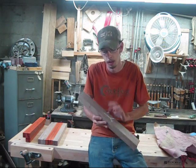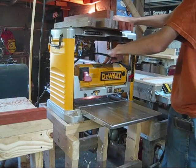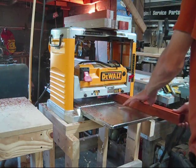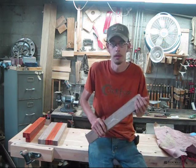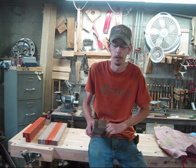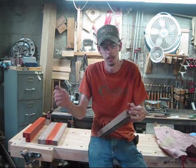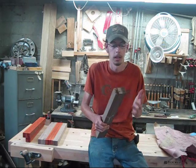Once you've marked the milled side, take it over to your planer, lay the marked side flat on the table, and run it through. That will make the top flat and parallel to the bottom. Finally, mill it to desired width at the table saw — rip it about a sixteenth or even an eighth of an inch bigger than your final dimension, just to be safe. That way, if your saw blade slipped or your fence isn't perfectly aligned, you can still run it through the planer and get a perfectly square board.